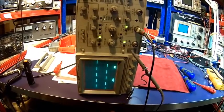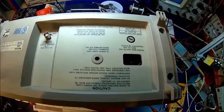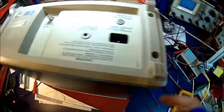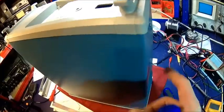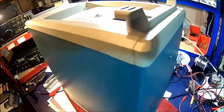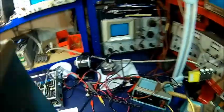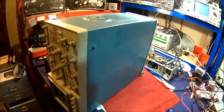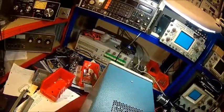Let's put the cover back on and do a few more tests. Taking these Tektronix scopes apart is pretty simple — there are four screws at the back, and then you can take the plastic off. When you want to take the cover off, don't forget the grounding screw, otherwise you can't pull the cover off. The cover looks pretty good after cleaning. Apparently it was a rack mount, so there is no handle and no feet. Apart from a few scratches, the thing looks pretty good. The serial number is B026409 — I guess it was late 80s, probably early 90s.